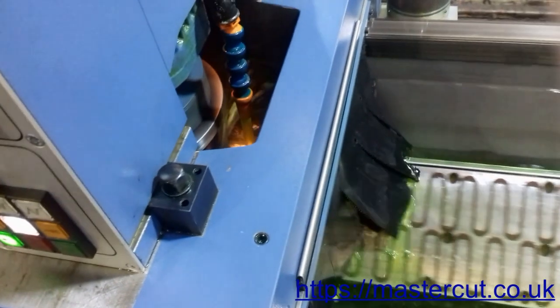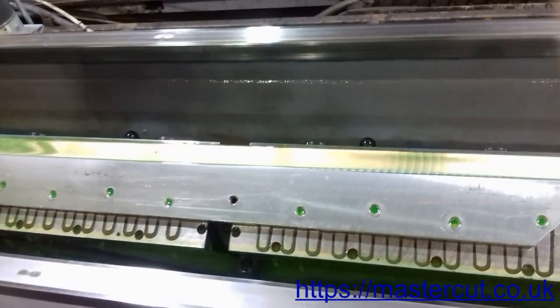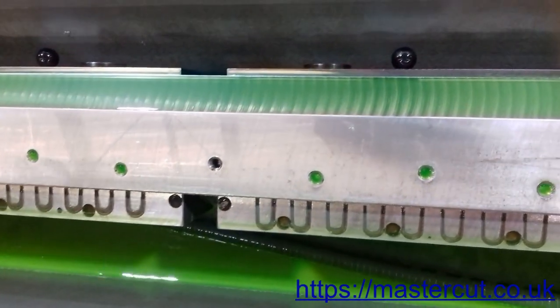For instance, if there is about 19mm of useful hard steel on new blades, whereas we take off less than 0.2mm during normal sharpening, we must remove a lot more to restore a chipped edge.